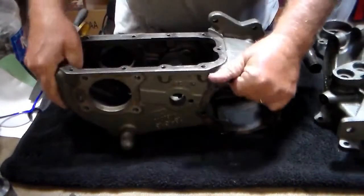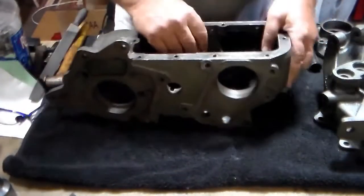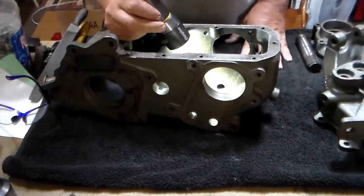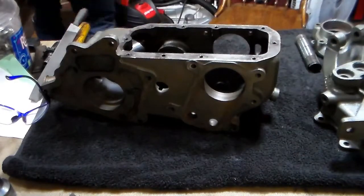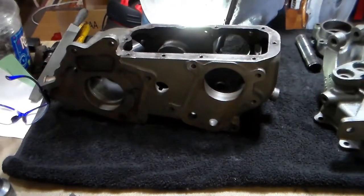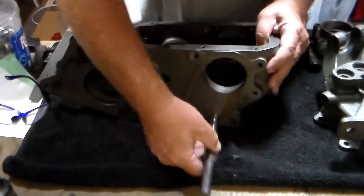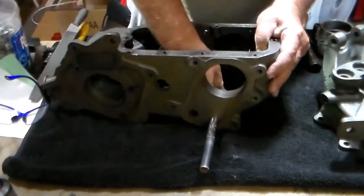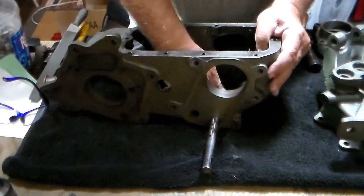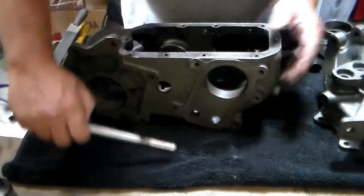The last thing you want to check on this, aside from cleanliness, is you want to look at that hole right there. In that hole is going to be the fit for this shaft. There's no bushing or anything else in there — it's just an open fit. You want to make sure that it doesn't wobble around too much in there. Make sure there's nothing in there and make sure it's not cracked. That's going to be your last fit on that.